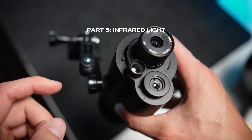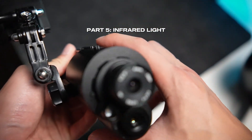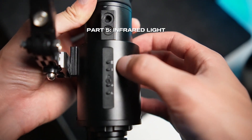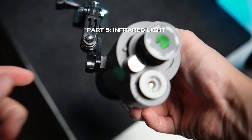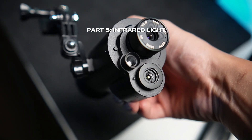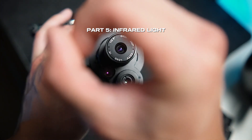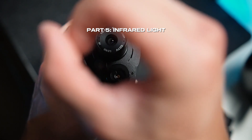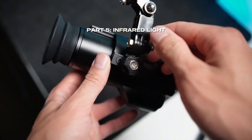In order to toggle the infrared light on to get the illumination you want in this mode, you want to press the IR button, which is right here. The reason we coded the IR button to be separate is because some people like to keep their light discipline. That way they are able to — as you can see the little pink-purple light there — they're able to choose to turn that on or off at their own discretion if they don't want to spill IR flood all over the place.